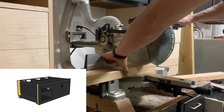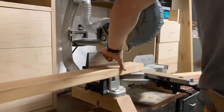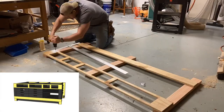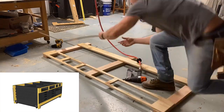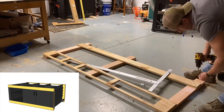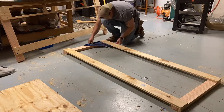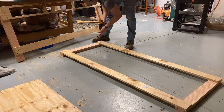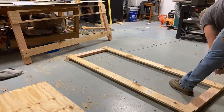The four legs are just made out of two by fours. When you're attaching the top and bottom braces to the legs, you want to be sure everything is nice, straight, and square. What I did is I threw a bunch of glue on it, hit it with a brad nail or two just to hold it in place — enough if I needed to do any micro adjustments. Once it was square, I threw five screws in at all the joints.